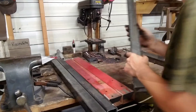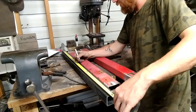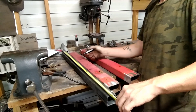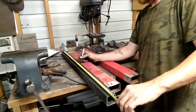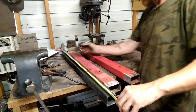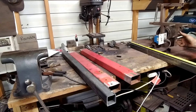I have four of them cut at 2 foot. If you find the center of this at 18 inches — our anvil is 7 inches wide, so 3.5 inches each direction of that center point is where the edge of our anvil will be.